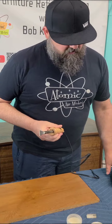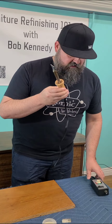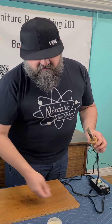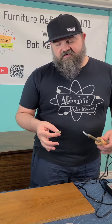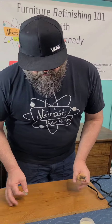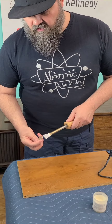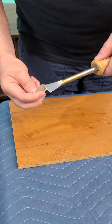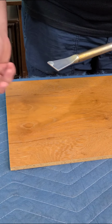What it requires is an electric burn-in knife and a regulator for that knife, because you don't want it getting too hot — it'll bubble the material you're doing your burn-in with, and those bubbles will remain in there. Once your burn-in knife is hot, you just melt a little bit of material on there. This is a hard acrylic stick — getting harder and harder to find because not many people are doing these repairs.